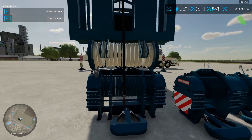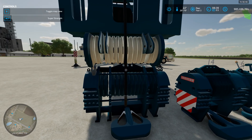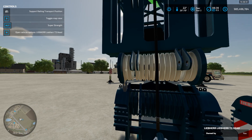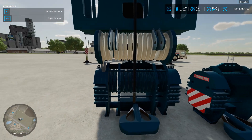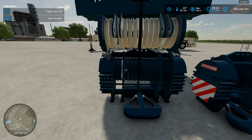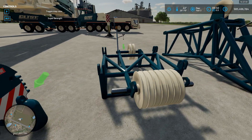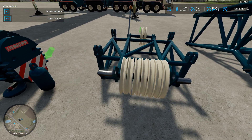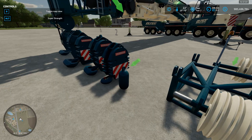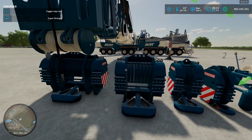You'll then be able to attach the hook. Keep in mind if you have a 26-line hook, this is the only place you can attach it — because you have 13 sheaves on the head and 13 sheaves on the hook. When we get to the T7 and the NM head, it only has seven sheaves, so the maximum you can put on that head is the 14-line configuration.